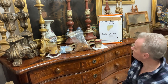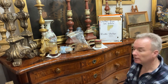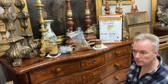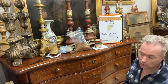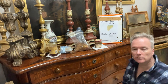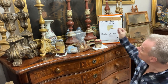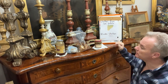Shellac dries very quickly. When it's dry you can add another coat — if it doesn't dry quickly you can use a hairdryer. It doesn't have a long tail-off drying period like oil-based varnish which takes days to dry. When it's dry, it's dry — it dries dead flat, shrinks slightly, and dries shiny. You can use wire wool to make it shinier or less shiny. It's very versatile. If you're doing an old wall painting that's flaking, the shellac will hold all the flakes and the darkness will unify any repairs or retouching. You have to work quite fast — if you put it on and want to make a finish, you can't go back over it without uplifting the previous layer, because it is soluble with meths.